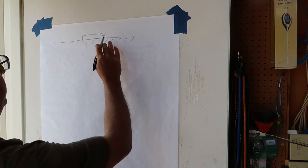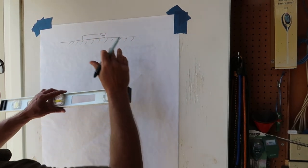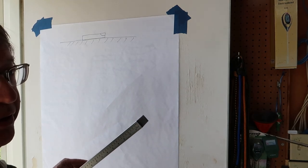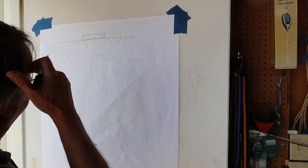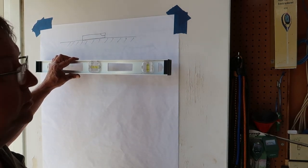And let's say you put that level on a perfectly horizontal surface. Well, there's nothing to make that air bubble move to the center because it's already level. The entire cylinder is level. That bubble's not going to go to the center just because a human wants to know that he's sitting on level. It's going to go there only if there's a force, and there's no force moving that air bubble. That's why a perfectly cylindrical glass vial would be useless for a level.